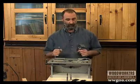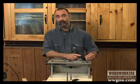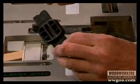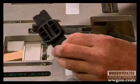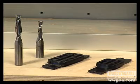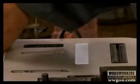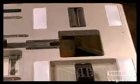Here's the way the whole thing works. There are a bunch of different guides that can be used with the jig, and the guides control what size mortise and tenon joint you'll create. It's clearly marked on the guide what dimension mortise and tenon this one will cut. So by marrying different guides to different sizes of router bits, the jig will allow you to produce a whole variety of mortise and tenon sizes. The guides themselves snap into the top of the jig here.